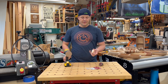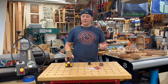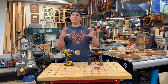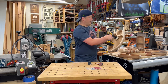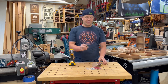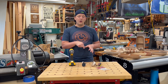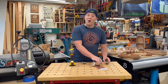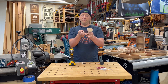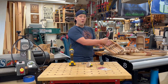Drill adapters — basically just a little adapter with a foam pad and velcro, and then sand away. These are great because most of us have a drill, and again it's that smaller footprint. As opposed to five or six inches of a random orbital sander, I can really get in and sand around. There are other options — I can switch to all the different sizes, smaller and smaller, even down to a one inch, which is great for hard to reach places. You can also do extenders. If you want a little bit more contouring, you have firm foam, and then on top you can add a little bit more cushion, which helps when getting up into a corner and the side.